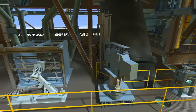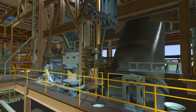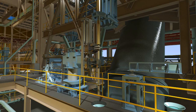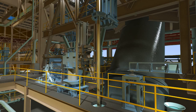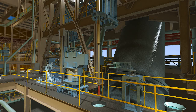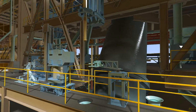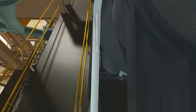After the probe stands upright, the loading device of the manipulator rotates the probe and moves it to the sublance position. It is then ascended by 800 mm and the probe is mounted on the sublance. After the probe is mounted, the grab is opened and the loading device moves to the original position, completing the sublance measurement preparation. The used probe is detached after measurement; the unloading device of the manipulator moves forward to disassemble and rotate the probe, and the waste probe is dropped to the 12.5 meter position through the drop chute for disposal.